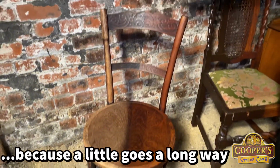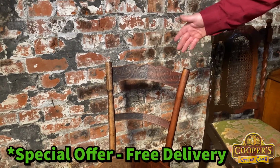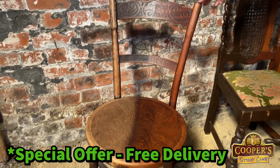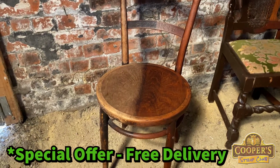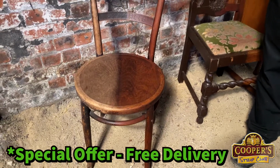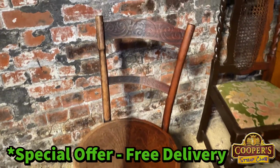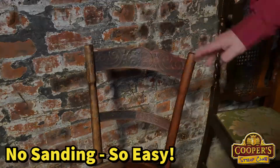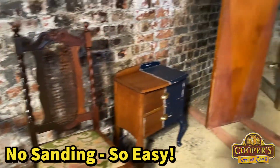Again, just allow more. The more varnish or paint you've got on, the more product you're going to use. I've seen some with super thick layers of paint on these chairs. Exactly, and we're not saying one puff of stripper is going to magically go through 30 coats of paint. We do know there is no paint it won't go through, but the thicker the paint, the more product you will use, but nothing like a gel. So, come over and have a look at our weatherboard.